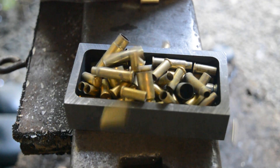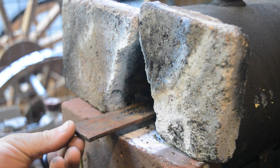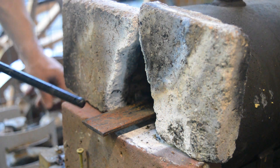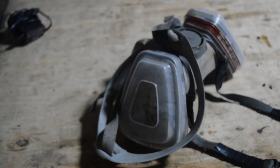After a while I got tired of stacking one at a time, so I started pouring them in — this works well too. I'm going to slide it into the forge with this piece of steel underneath, which just makes it easier to maneuver. When you pull it out to add more brass, you'll need a respirator for the fumes.